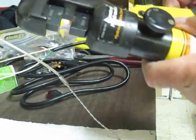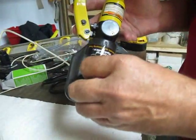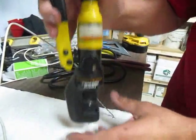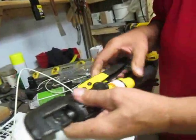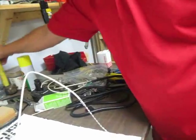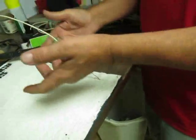You need one that is like this — this actually has 1,500 pounds of pressure. You put the two wires in there, put the connector in, and see how it crushes it? So you have 1,500 pounds of pressure. I bought this at Harbor Freight, it's like $20 to $30, but it's worth having. The other option is to take a hammer and just hit it really hard, but you really need that connected well. Otherwise the wire will arc and melt away right away.